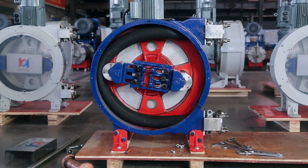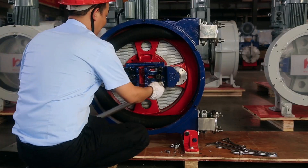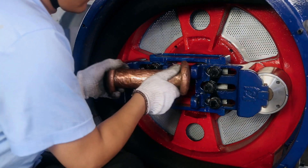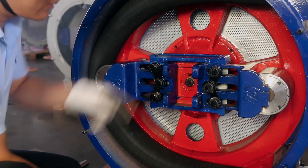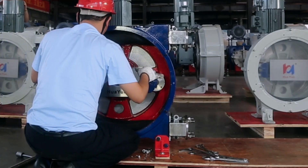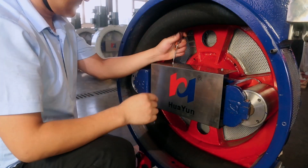Start the pump and let the rotor rotate 180 degrees. Loosen the bolts of the right roller support arm and extend the pressure roller until it is aligned with the zero position of the support arm. After restoring the factory pressure defaults, tighten the arm bolts and install back the rotor guard plate and tighten the screws.